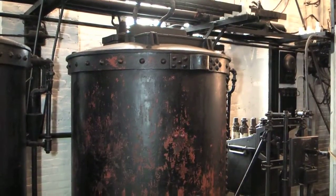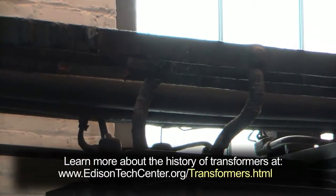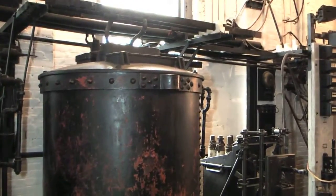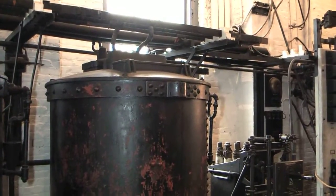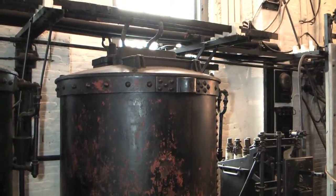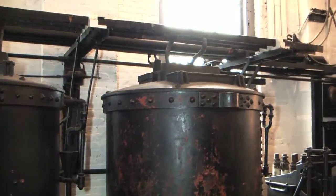The voltage was fed into these transformers at 800 volts, and the interaction between the coils in the transformer elevated it to 11,000 volts. 11,000 volts provided the 22-mile transmission without intermediate transforming or boosting to Sacramento Station A at about a 10 percent reduction — they got down there at 10,000 volts.